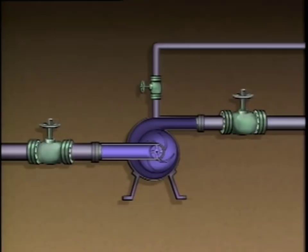Once the pump casing is full of liquid, the vent valve is shut, and then the pump driver is started. Centrifugal pumps can be started up and shut down in a number of ways. The procedures used often depend on the type of centrifugal pump, the type of driver, why the pump is being shut down or started up, and company operating procedures. We'll look at some basic steps, but keep in mind that you'll always need to follow the specific procedures used by your company.